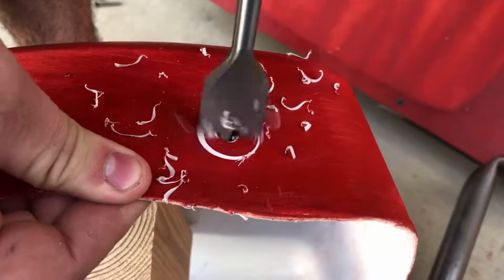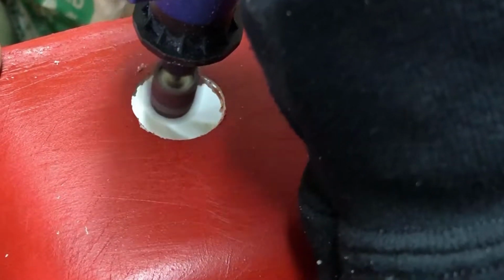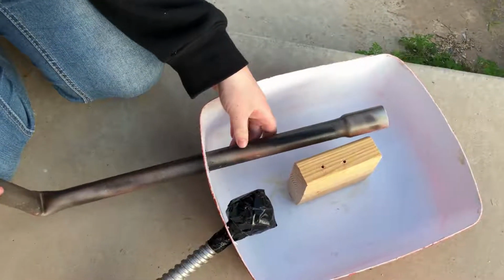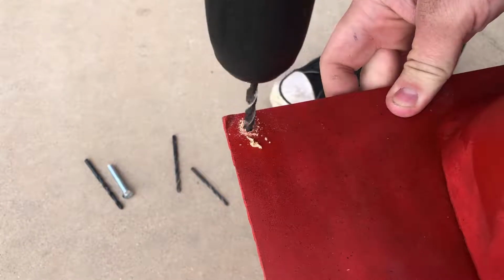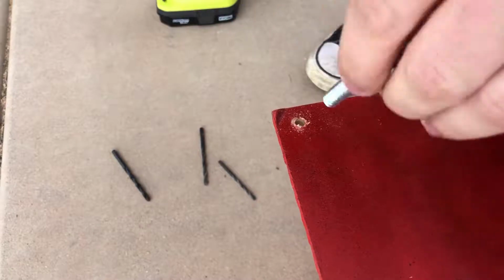We took that same drill bit and used it on the other side of the bottom of the bin to make another hole, and used a Dremel to make the hole a little bit bigger since it didn't quite fit. Once that was done, we fed it through the bottom of the hole and it hung the same way as the other pipe. We then went ahead and attached the wash bowl to the back panel with 2 screws this time to make sure it didn't spin around. After ensuring the fitting of the pipe, we drilled a hole in all 4 corners of our panel.